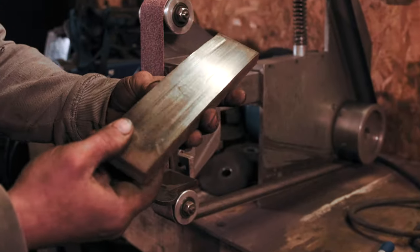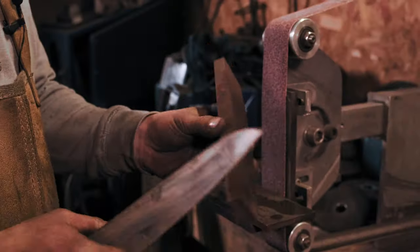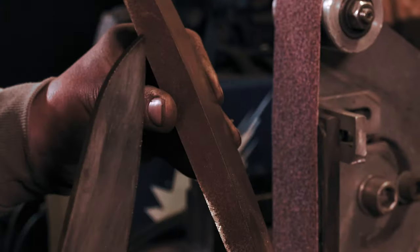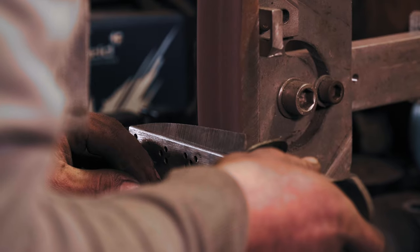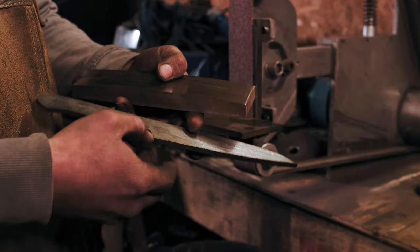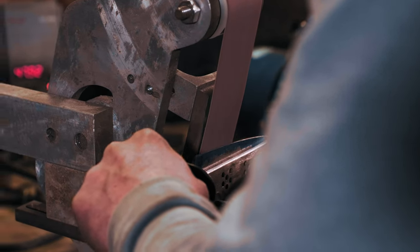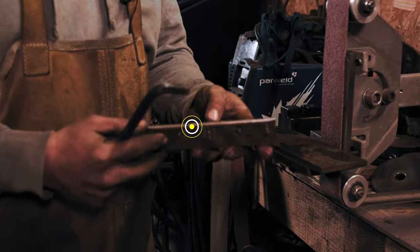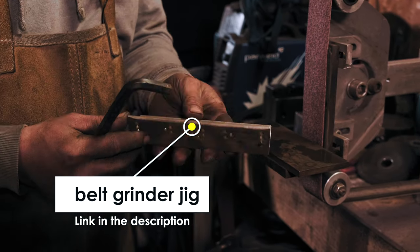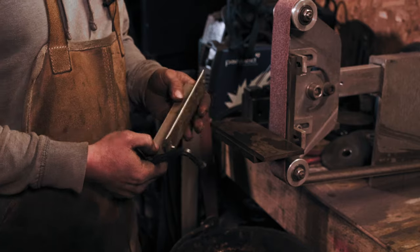So this is the radius platen. It's actually like a 98-inch radius, which is huge - it's very, very shallow. You can see very shallow concave. We're going to use that on the back side, gently hollow out a tiny amount of material at the back of the blade. This side will be a flat chisel grind up to hopefully in line with the handle, so you get this very wedge-like but very, very sharp bevel. This is my blade grinding jig. It's really, really very basic - bit of stainless steel angle with some holes in it. Clamp my blade to it with a tiny little C-clamp, and that's all it is. That's all it needs to be.